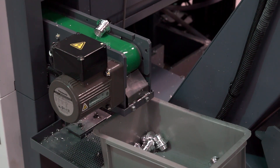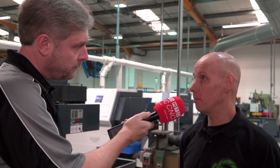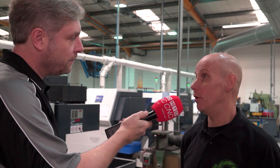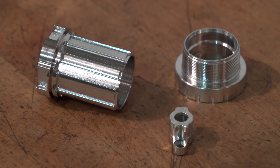That's your sliding head. Moving on to the fixed head side of things, you've got single spindle single turret and twin spindle twin turret — both good? The fact that we can finish jobs completely without any deburring or anything like that. When it comes off into the part catcher, that's it — it's finished.